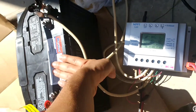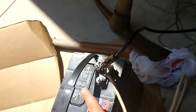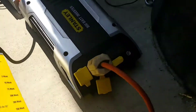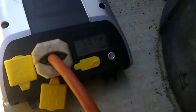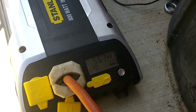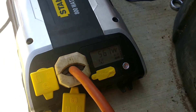And then the way I use energy is with my inverter, which I have hooked up temporarily with the clamps right here. And then that gives me power here. Right now I'm using 550 to 560 watts of continuous power — that's how much the air conditioner I have is consuming.